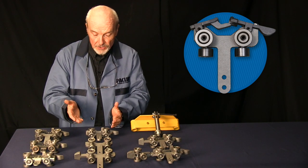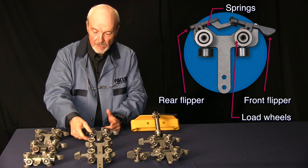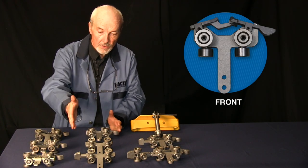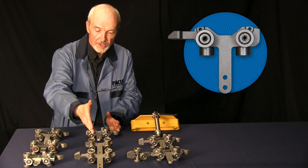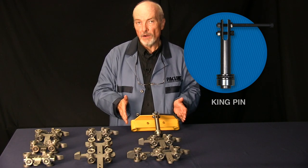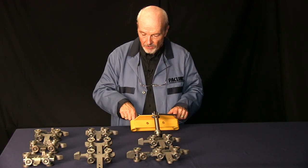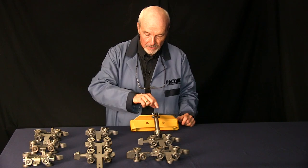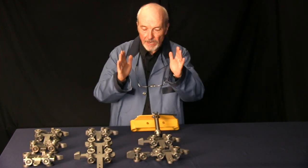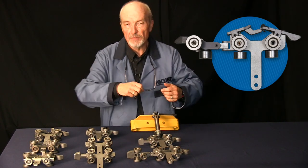The basic parts of the trolley are the front flipper, the rear flipper, the springs, the load wheels with axles that press through, and the side guide wheels. There are three different trolley types — in a three-trolley set there's a front and a rear for accumulation, plus intermediate trolleys. They attach to a kingpin on a load bar at various lengths. This shorter one provides about 12-inch accumulation. If you don't want a two-trolley arrangement, you can get a 7-inch accumulation combo trolley or a 10-inch accumulation with a caboose-type trolley.